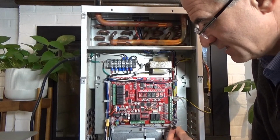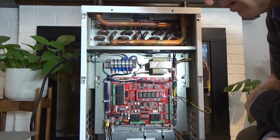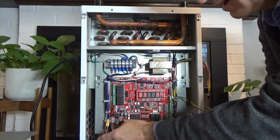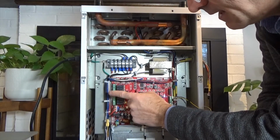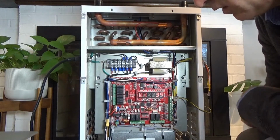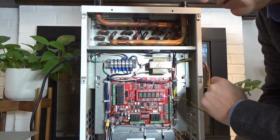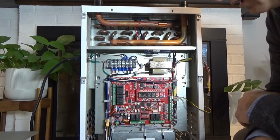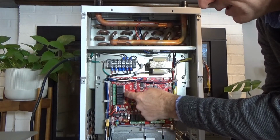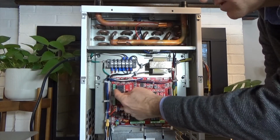So it's looking for the humidity level at the sensor, and if the humidity is below the set level, so if my humidity level is 35%, for example, then I would call on my humidifier at this point. So I have HUM right here, these 2 points. Now, when I call that on, an LED light is going to illuminate on this side of the relay. So you can always tell what is going on inside the iFLOW controller, because there will be an appropriate light that illuminates on either side of the relay.